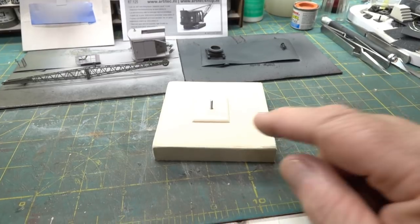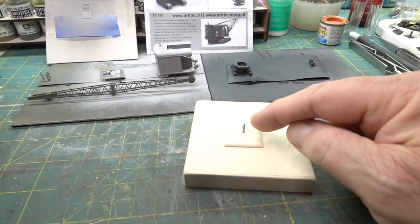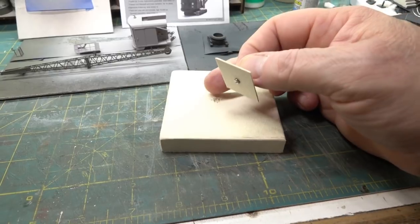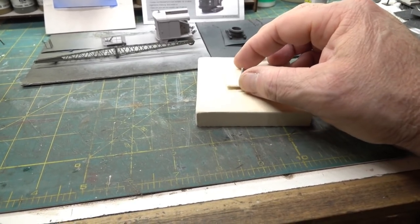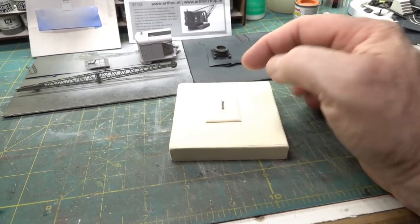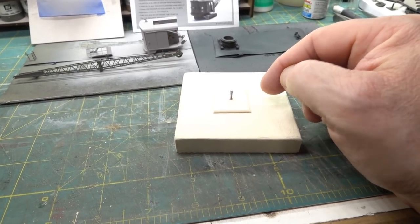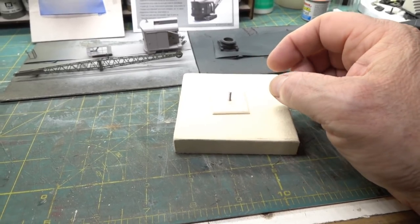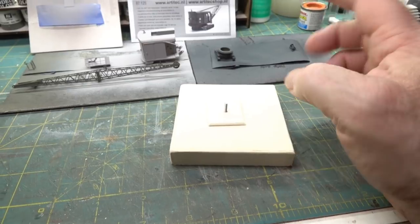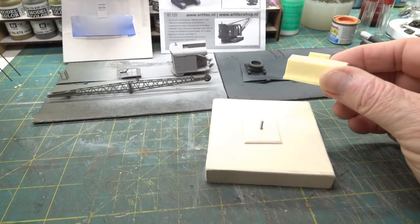I did want the crane to move a little bit, so I drilled and tapped into the bottom of it for a 2-56 screw. It works pretty good. I have a little depression cut out in the center of the pad for when it sits down, and then I can thread the screw in so it's snug but still lets me swivel the crane a little bit. I don't claim to be a machinist — it seemed to tap okay and the threads are actually there.